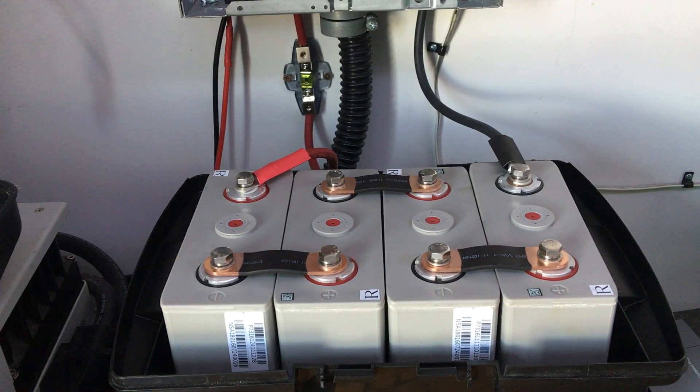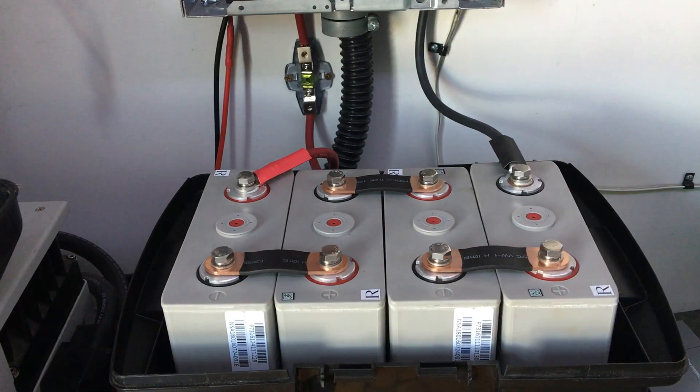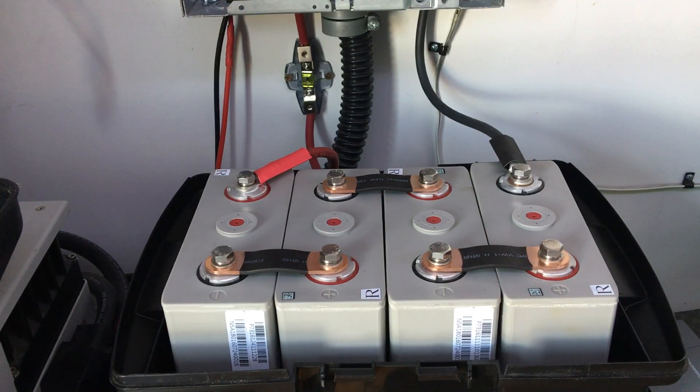I don't have any kind of battery management system on it right now, but the key is you've got to make sure all four cells stay at the same voltage. There are a bunch of different ways to do it, but right now I'm just going to put a meter on every single one to see how quickly the cells become out of balance. I'll have a battery management system on there once I get the information I need, but for now I'm testing capacity, discharge rates, charge rates, and how long it takes for the cells to become out of balance. They came perfectly balanced from the factory. Thank you for watching — www.lightharvestsolar.com.